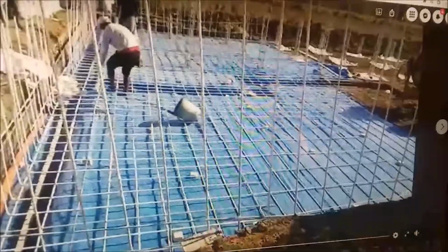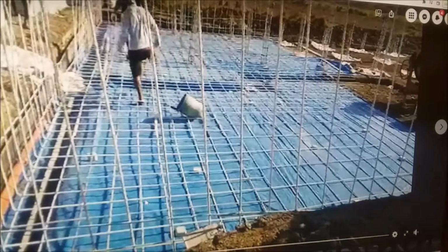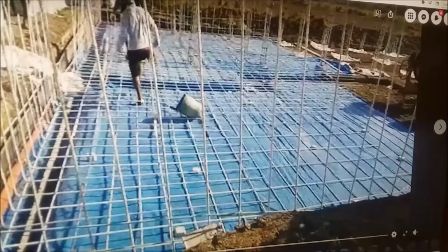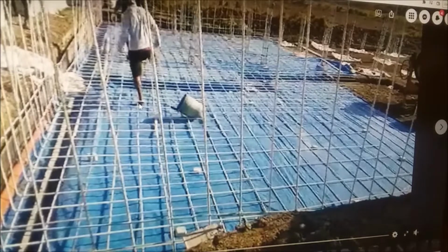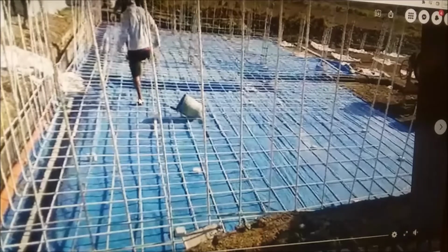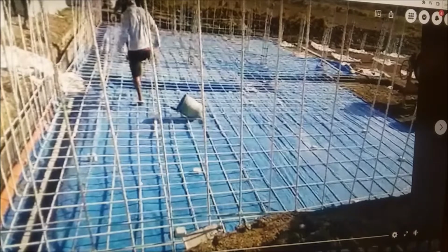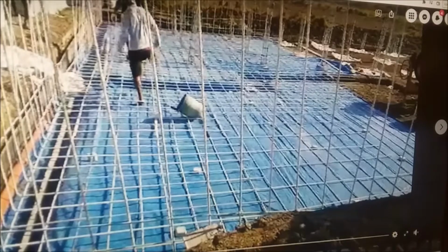You've got to be real careful walking around. When they get all the tie wires in here, you can see that those squares are not a whole lot bigger than his feet. And those little ends, if you don't push them just right when you take the twister off, they can scratch them up pretty bad. Sometimes they put 2-foot strips of phenolic board down to do the major walking, but they haven't got it down here because there's just not that much to warrant it.